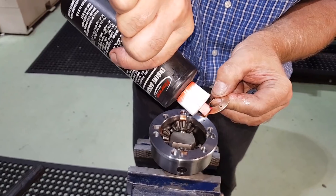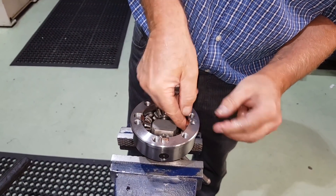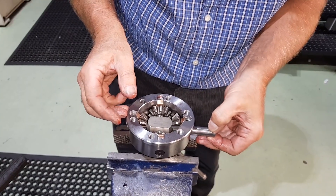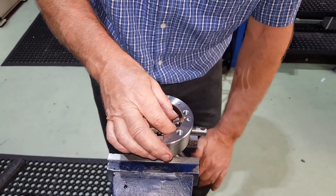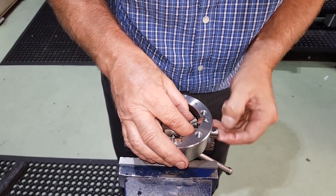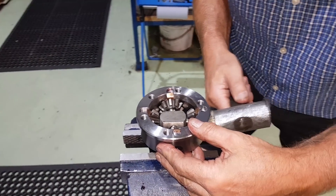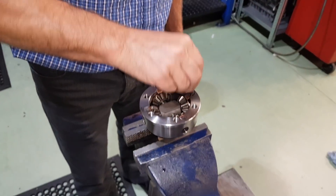A little bit of the jam again. Planet gear in place. Now the shaft again — make sure this hole is totally vertical, otherwise it will not go together. Just nip it up a touch more, then tap it finally with a soft-face mallet or similar into place, and screw down the top.